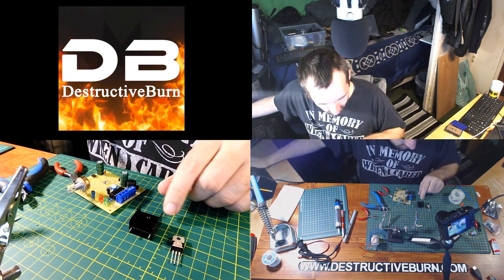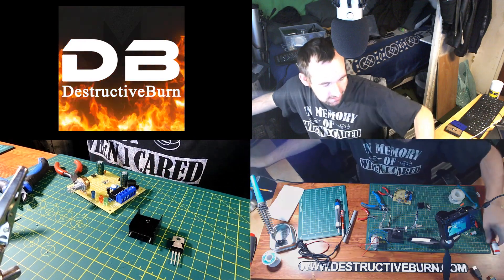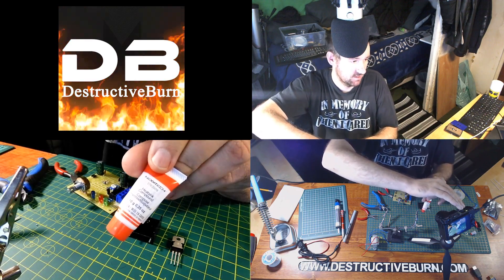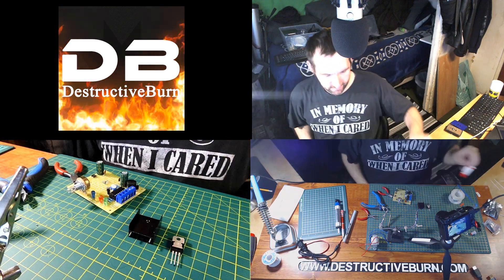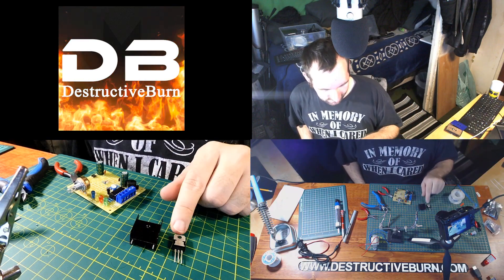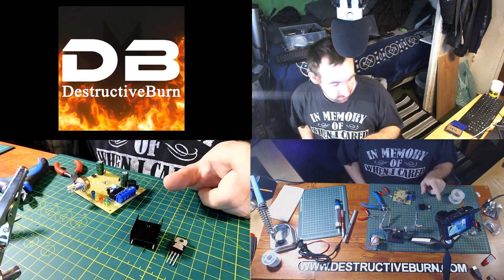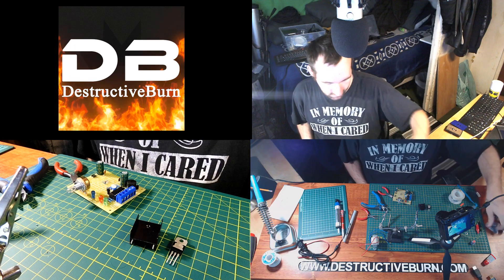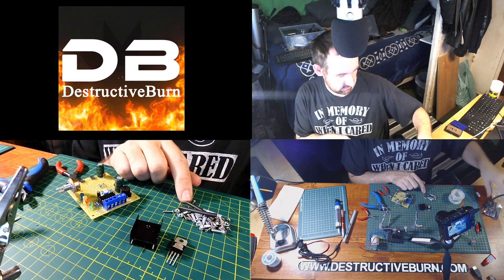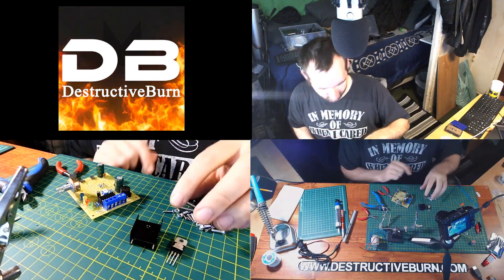The next step is to put the voltage regulator onto the heat sink. I recommend using some thermal paste — I've had this here for quite a few years, so hopefully it's still good; if not I have thermal tape as well. It's best to always use some type of thermal grease between the regulator and the heat sink. Now I've got to find the screws — the casing is the most annoying part to figure out.